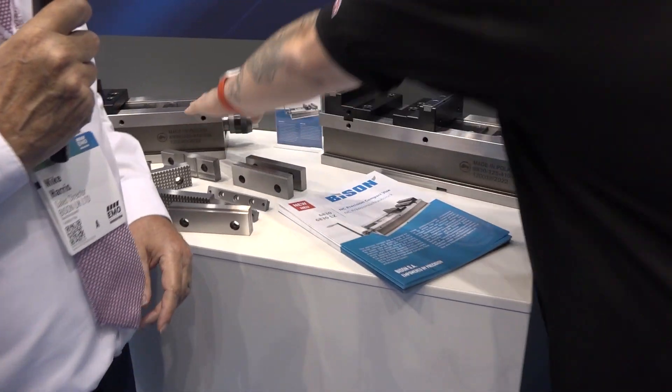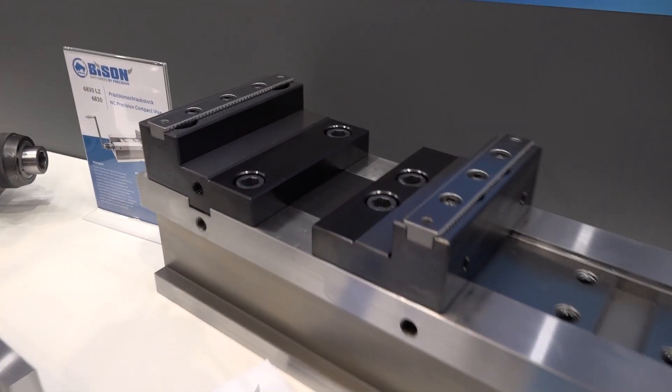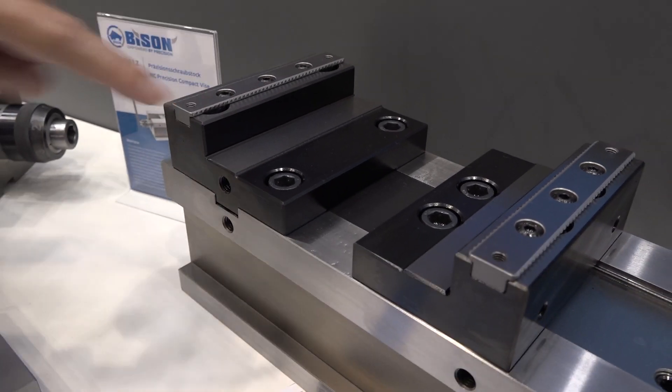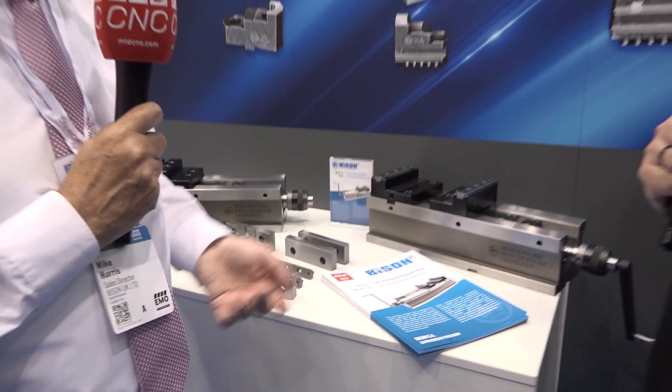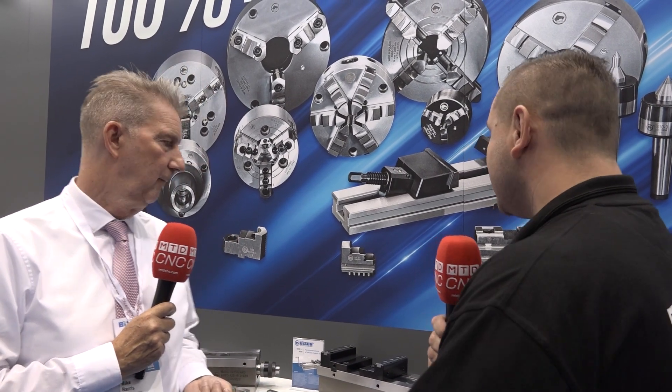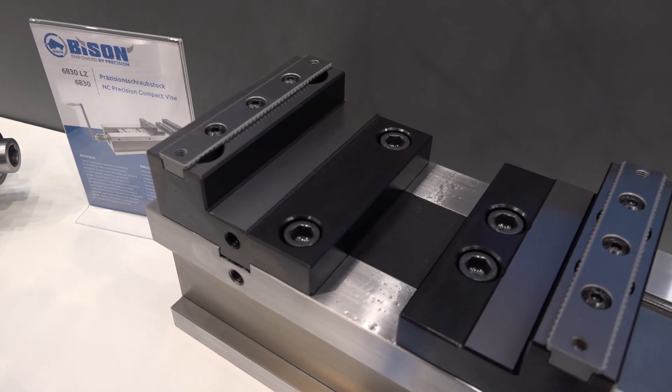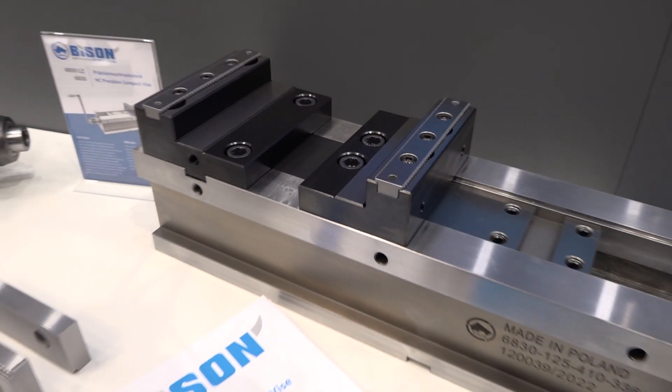This is a new version — you had the conventional one before, but this one now has a serrated strip on the top, three millimeters, so again saving on material. It's an adaptation on a conventional vice. The great thing is you can change these — it's not just a first-stop vice. A lot of vices with the three millimeter step are only for op one, but now this can be used for op one, op two, three, four — as many operations as you need.